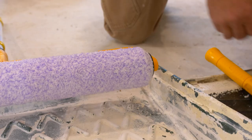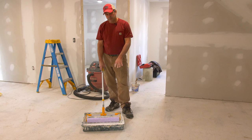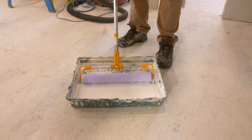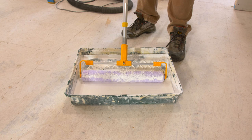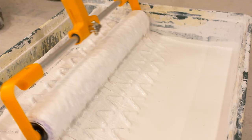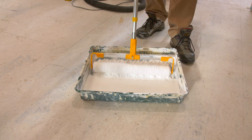The first step to priming a wall is loading up your roller with paint. What you don't want to do is submerge the roller nap fully in paint and get paint up onto the roller frame, because it will drip and fly off, leaving drips and marks. Just dip into the paint, bring it back up onto your pan, and never fully submerge into the pool of paint, because you'll get your cage all covered with paint — and when you're doing the ceiling, it drips down on you and the floor.